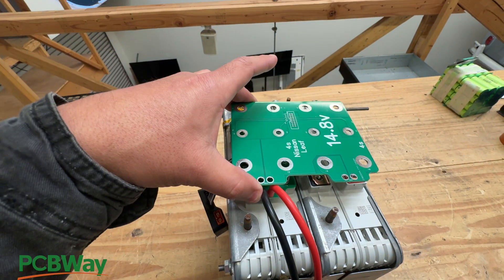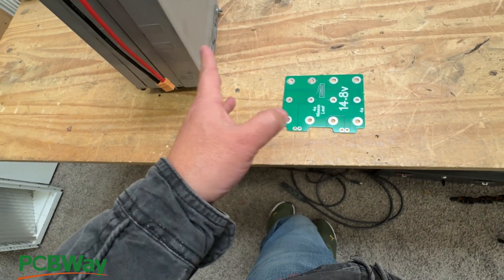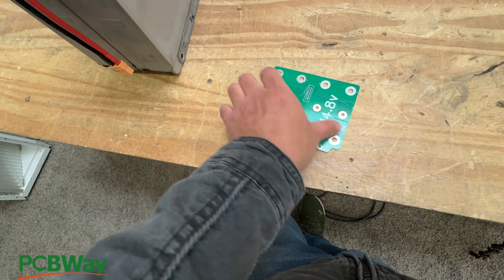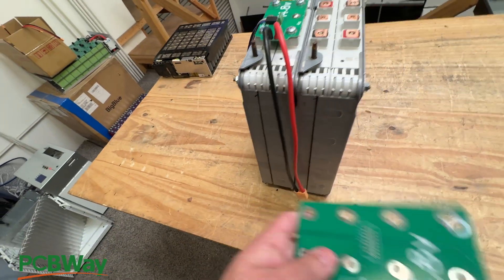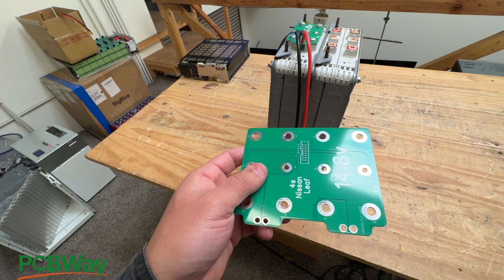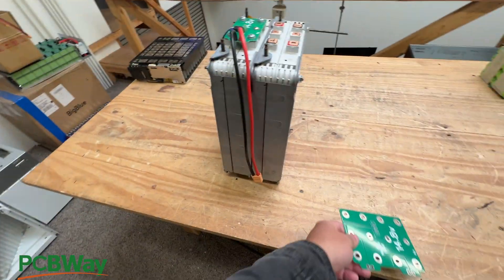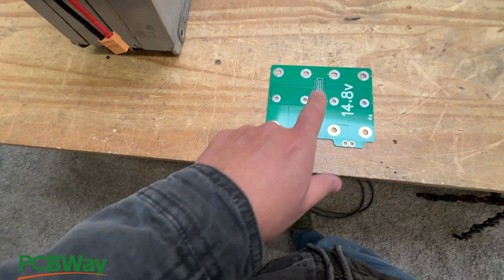I've also made a two-module board for the entire assembly, with two connectors or pigtails good for about 200 amps. If you want all 600 amps, you'd need to connect straight into the bus bars at the cell terminals. The two-module board helps you parallel the two modules safely - if they're completely mismatched in state of charge, you could see hundreds of amps flowing between them and sparks when installing. Always make sure batteries you're connecting in parallel are at roughly the same state of charge. With that done, you have a very powerful 12-volt battery capable of about 600 amps.